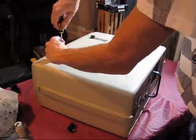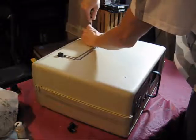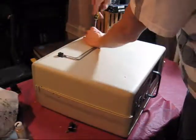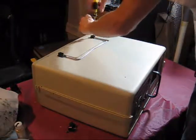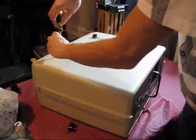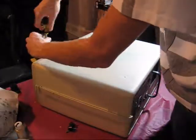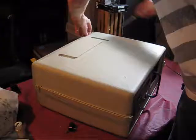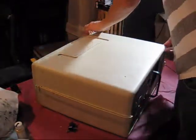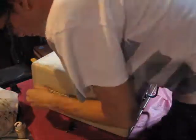The Corona has a 2-piece plastic shell with no access doors, so the whole casing has to come off. On the bottom there are 6 screws holding the rubber feet on and another 2 screws in the front bezel. I had hoped these screws would be the only things holding it together, but after jiggling it for a few minutes it still caught on something. Removing the screws from the rear panel allowed for some more wiggle room, and eventually I was able to shimmy the cover off.